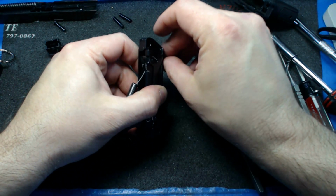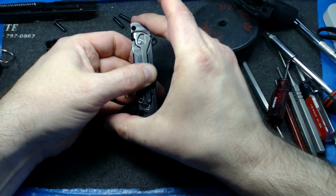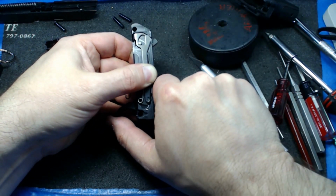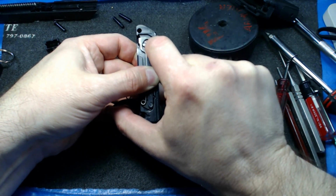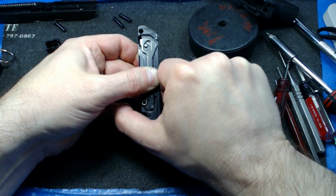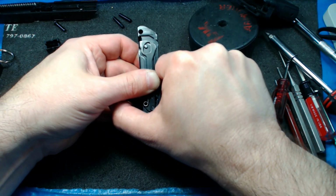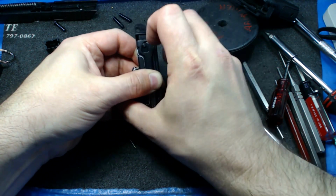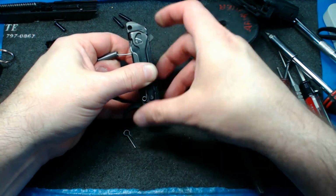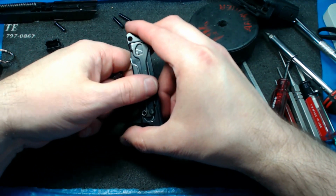So normally the trigger bar is gonna have the hammer there, and you'll see as I pull the trigger, the hammer is going further back, but because this bar is going to be pushed lower and lower, it's going to slip off the back of the hammer right about there, at which point that spring would pull the hammer the rest of the way forward. So try and do that all at once.